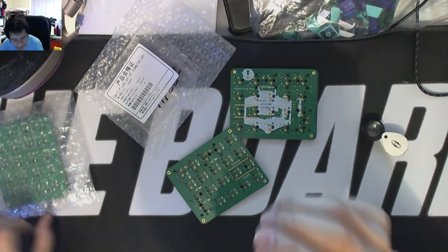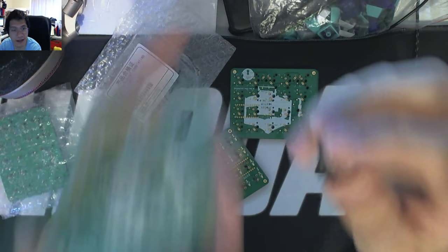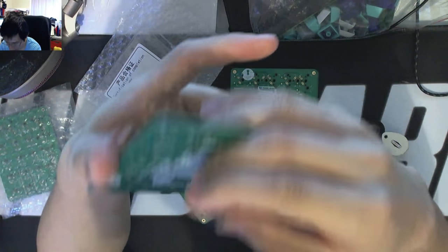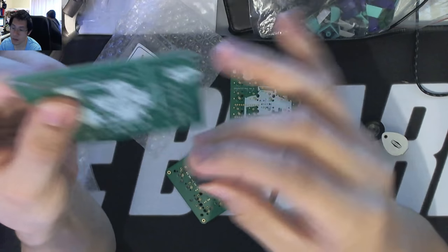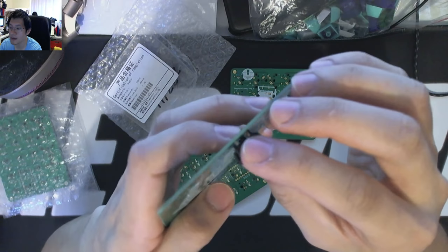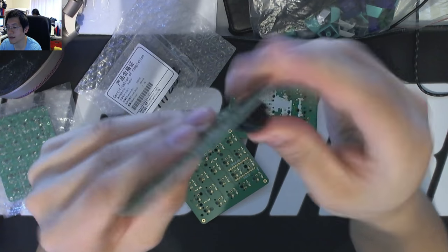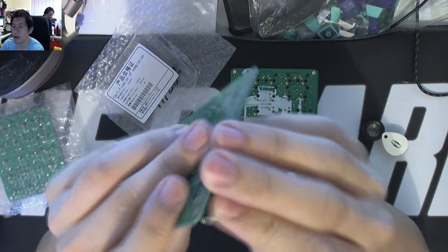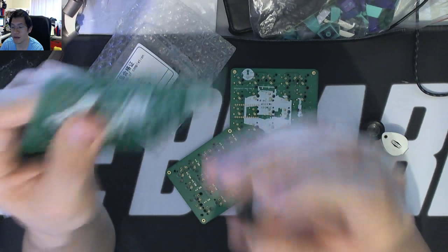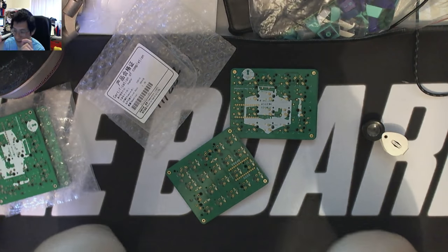Now, of course, to be fair, let's go back to the last batch of PCBs, because it's exactly the same Gerber file, right? It's exactly the same Gerber. And if I take this and I snap it into, where's my orientation? There's my orientation. And if I snap it into these, okay, so that doesn't fall out. And that's that same corner one, that doesn't fall out. So that's a second thing that is slightly different in this particular run with these gold plate ones, is that the drill holes seem to be a little bit larger and my switches are actually falling out of them.